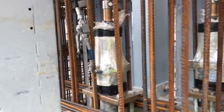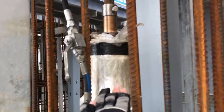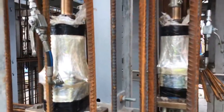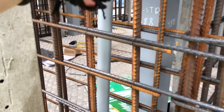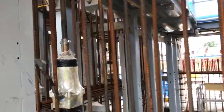You've got the hydraulic jacks here - that's how it all works. This is under pressure, sliding up on these pipes. Later, these pipes are extended - similar to splicing steel - you just put new pipes in to extend them so the slip form can climb on top. The idea is very good: it climbs on the pipe, and once the concrete is poured, the distance between the wall and the hydraulic jack to climb is not that high. Very clever system.